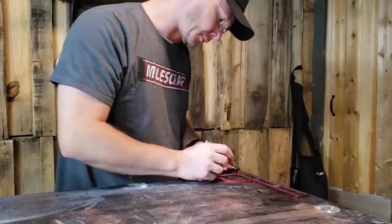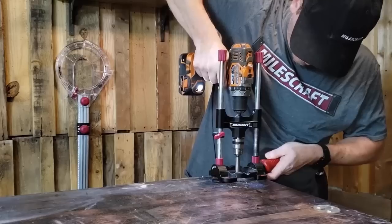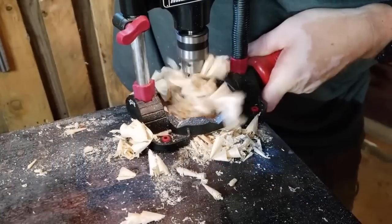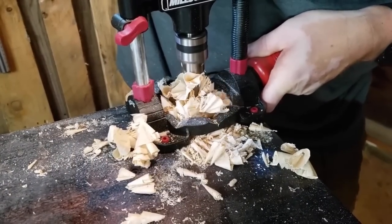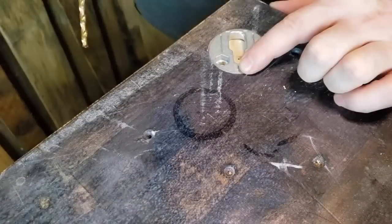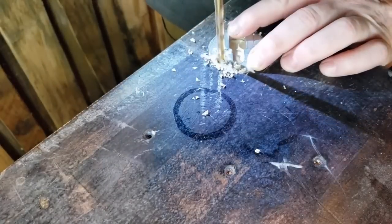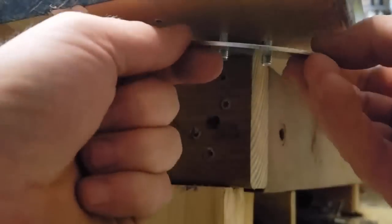Mounting clamp anchors is easy. With the included 2-inch Forstner bit chucked into your drill, determine your clamp anchor position and then drill until flush with the top of the bit. With a 1/4 inch bit, drill completely through the clamping surface and attach the support plate to the opposite side and secure with provided hardware.